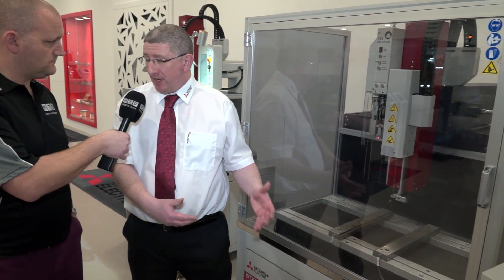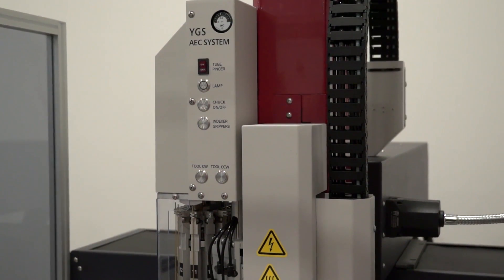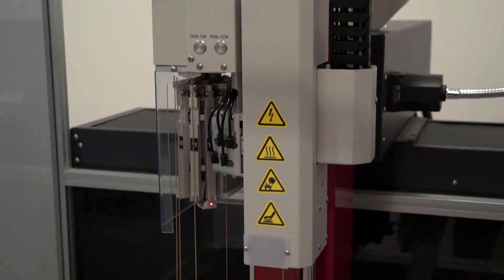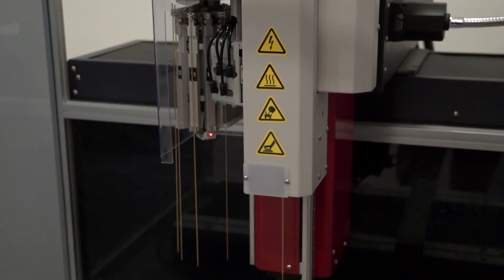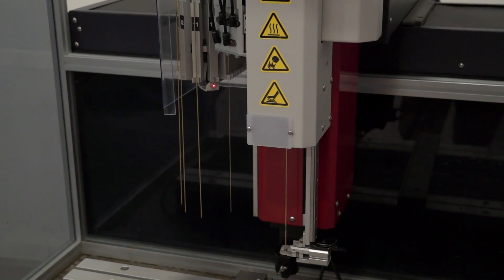That's right. We've got an entry level, manual type style machine that's behind us. But here we have our 64C unit. This has a granite work bed, a moving column — so it's not actually a moving table design — it's a little bit more rigidity, it's equipped with a rail system to make it quite easy to clamp parts, and also you have the option for an electrode tube changer.